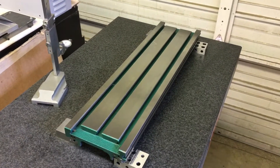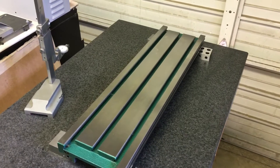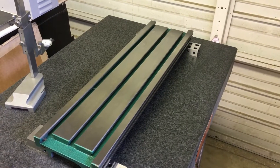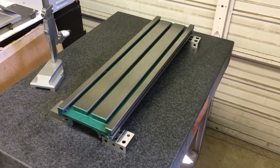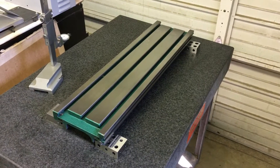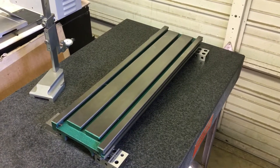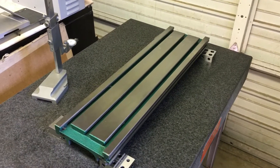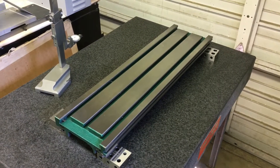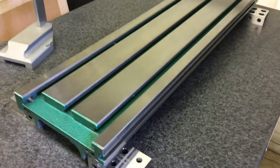Running the test indicator up and down the table is very nice. Gone are the 20-plus thou of pretzelism. The top of the table is perfectly ground to the rails. The deviation in the rail — call it like a half a thousandths, or maybe seven ten-thousandths sag in the middle of the table — that's from the rails. Big improvement to what it was.